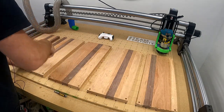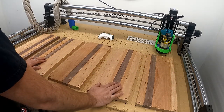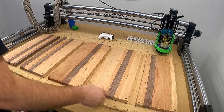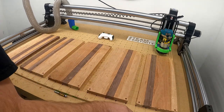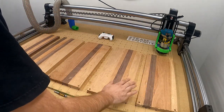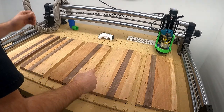Then I'll copy the shape onto there, copy the shape onto each one of these, then create my tool paths. For the planing run, I'll just do the entire big box. I'll add an inch onto this so the bit comes out, then goes back down, and I'll have it do those passes. I know that right here it's not going to be cutting anything. You know, it adds on a little bit of time, but for all the time I'm going to save, it's great.